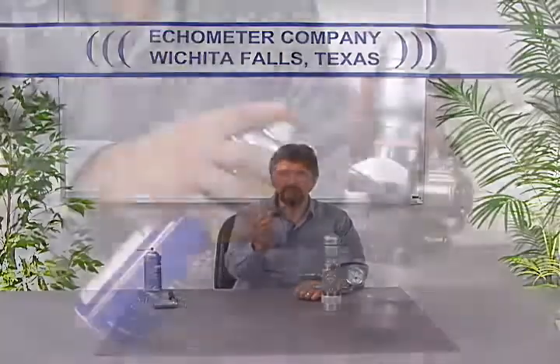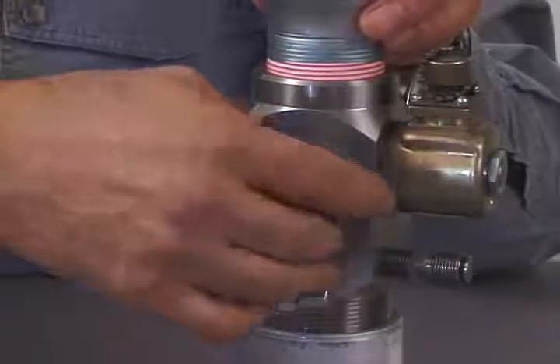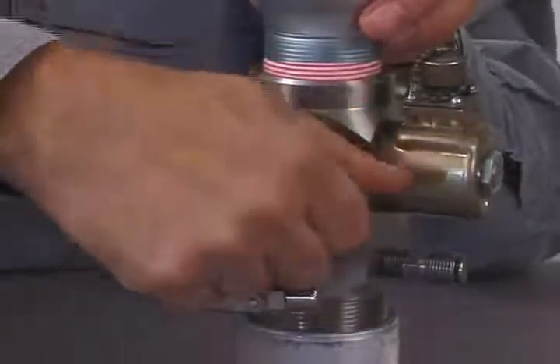Keep debris out of the filler connector housing. If debris in the housing causes the valve core to leak, lubricate the valve core with a light oil. Remove the filler connector housing before adding oil to the valve core. Be sure that the valve core is properly tightened while the filler connector housing is removed. Install the filler connector housing, then fill and discharge the gun a few times. Firing the gun multiple times will remove debris from the valve core. For more maintenance tips, check out our website at www.echometer.com. Echometer hopes you found this video informative. Thanks for watching.